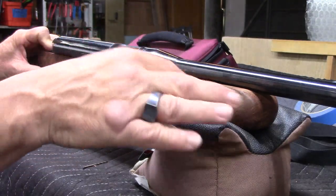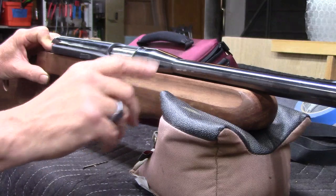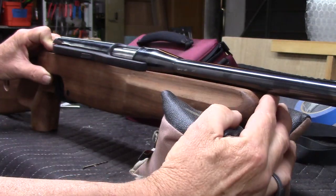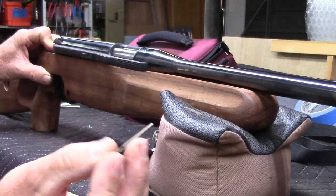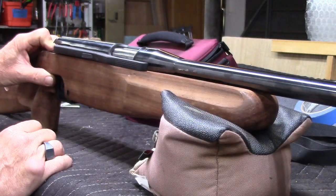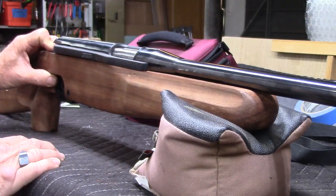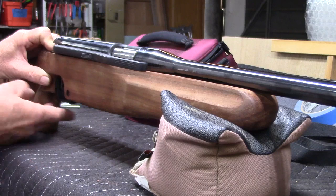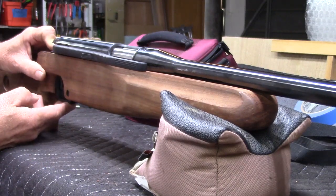And I think that all the dimensions, the clearances of the cocking handle to the top of the form, the clearance between the barrel channel and the barrel, which using a drill bit appears to be just about 3/32 of an inch, all seems like that's probably fine, but it is dropped down into the trigger assembly just a bit farther than intended from the factory.